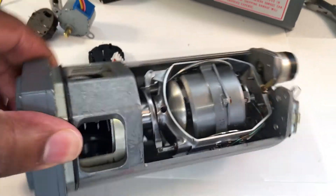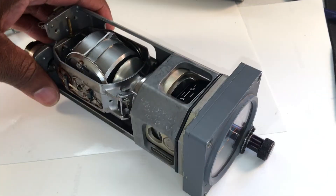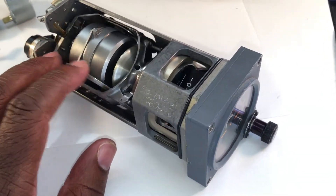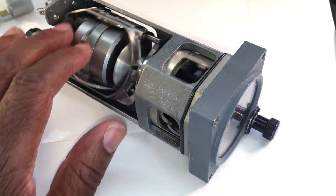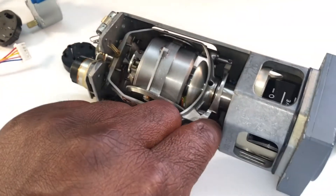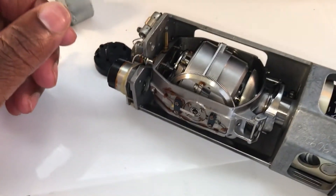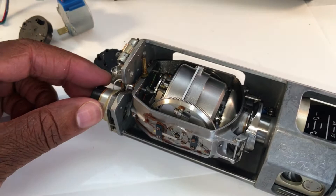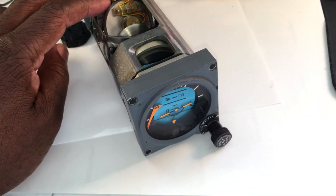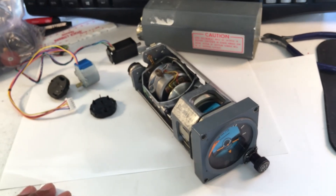So that's the thought process for modifying your instrument: you look at what the simulator is looking for and see how to get all your signals into it. That'll be two stepper motors — one for pitch, one for roll. We'll have to come up with a driver circuit for the flag motor, or otherwise replace that motor with something else to turn that shaft. The limit switch handles the cage. That's what gets you a standby ADI for your simulator. Thanks for watching and good luck with your cockpits.